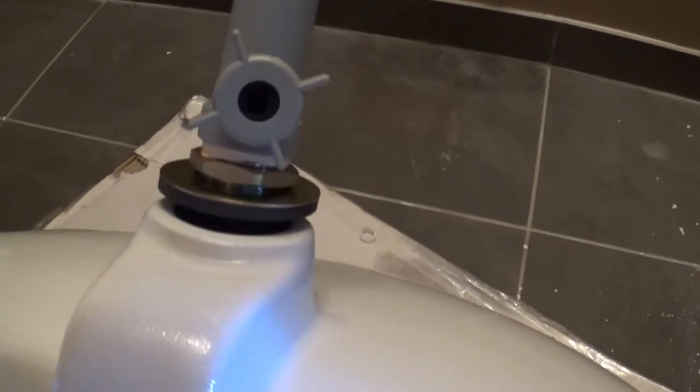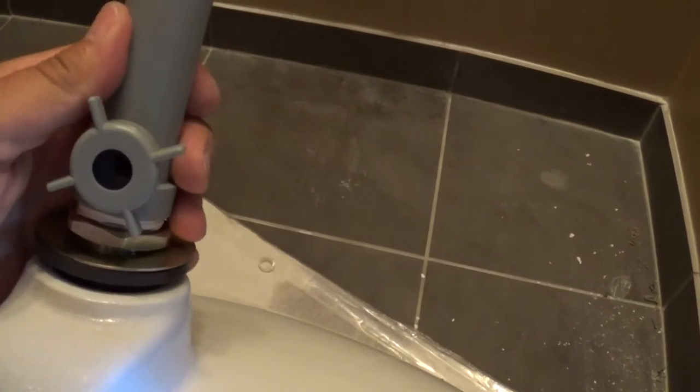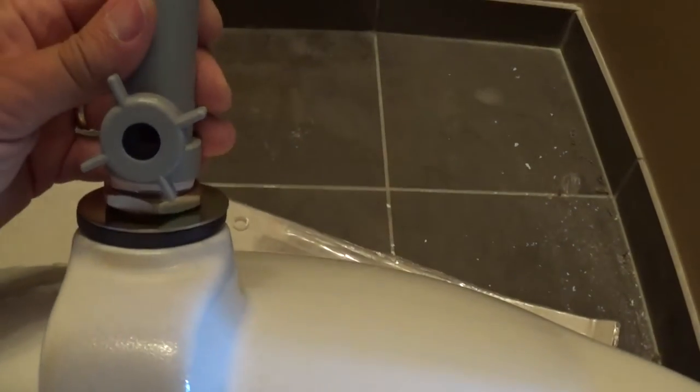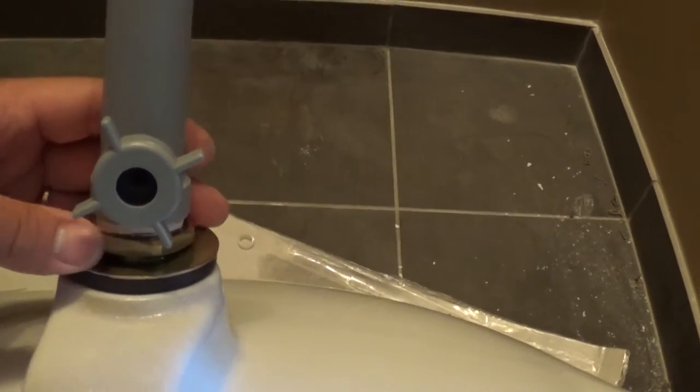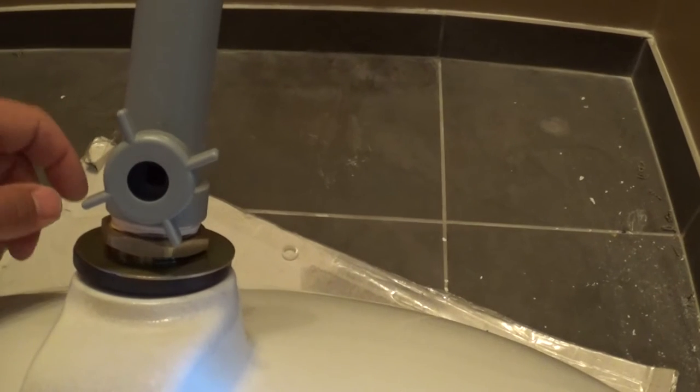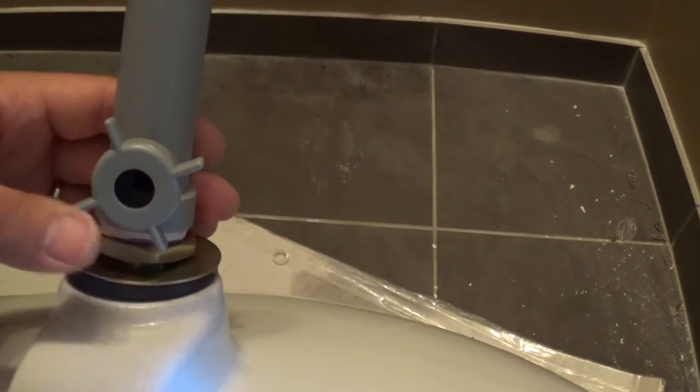There is another seal on the top of the bottom of the sink. We're going to throw some silicone sealant in there and seal that up, but when you seal that up, you've got to make sure that the pivot hole is mounted properly to the back of the sink, square. Because this is going to activate the pop-up seal for your sink — the seal that you use to manually open and close the drain. With this in place, you want to tighten the nut and not allow the whole assembly to spin, or your top seal of silicone will be compromised.